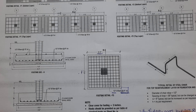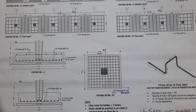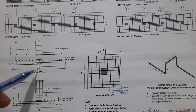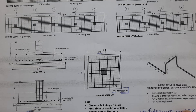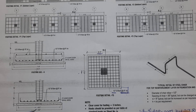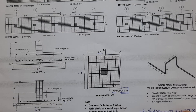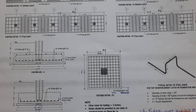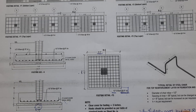We have different sizes of footings. One is eight feet and another is six feet two inches on all sides. With the three-inch concrete cover on all sides, the total dimension becomes six feet eight inches; without concrete cover it is six feet two inches, as you can see in this section and plan.